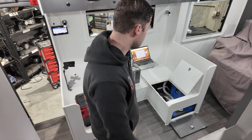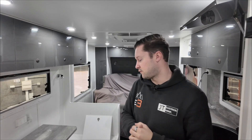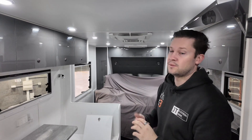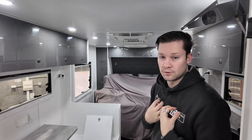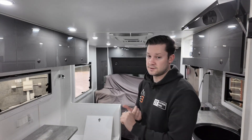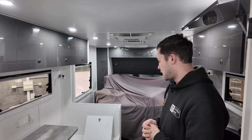I've already done a system test and basically just need to put the van back together, then I'll do the customer's handover video for this van. That's the Network RV caravan we've just completed with the full Victron retrofit. The customer is going to get documentation of the system — all the parts, all the serial numbers, all the warranties including batteries. We're liable for the warranties as the Victron dealer, and the customer will get a certificate from us with our license on it to say the system has been installed by a licensed electrician and complies with all AS 3001 installation requirements.